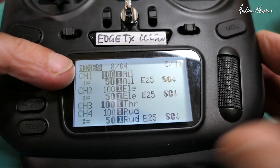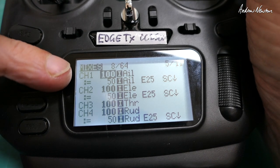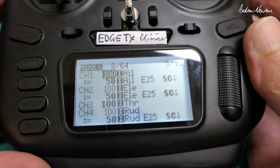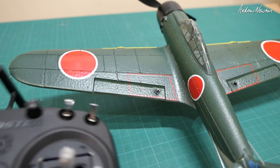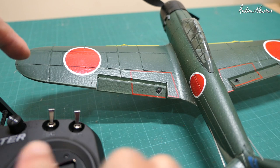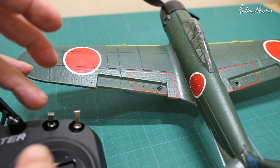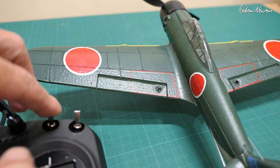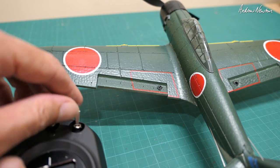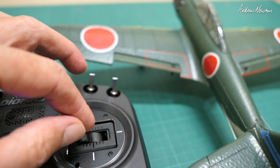So now we have 100% ailerons when SC is in the top position (beginner) and the middle position (mid), and 50% aileron with expo when the C switch is in the down position — expert mode. Here's what that actually looks like using my Boxer radio for the demonstration. There we have full aileron movement in beginner mode — a lot, but taken care of by the gyros. Same in mid mode. But when we switch to expert mode with the SC switch all the way down, you can see the control surface movement is much smoother and smaller. That should be a lot easier to fly in expert mode. Hope that makes sense, thanks for watching, and see you in the next video.